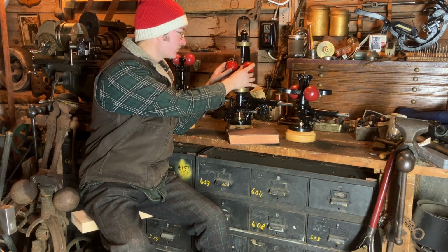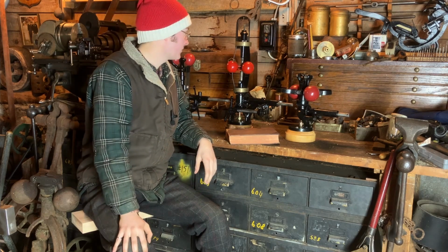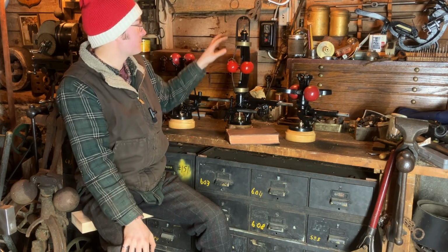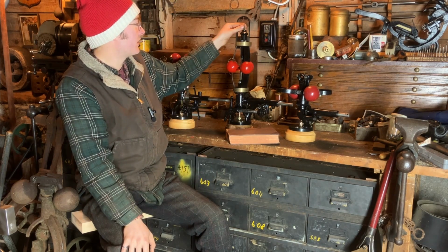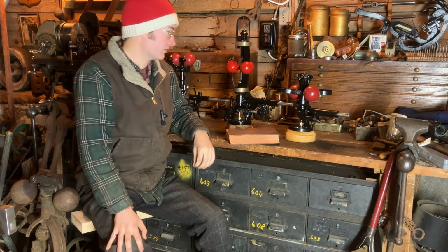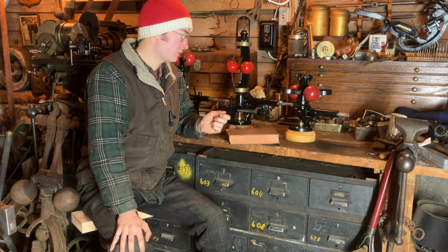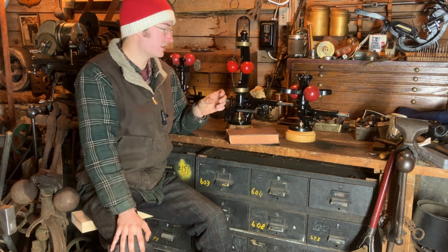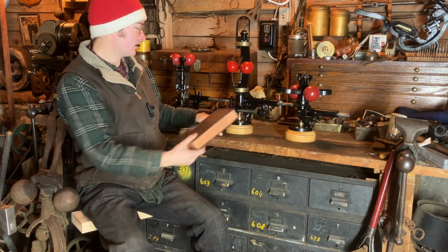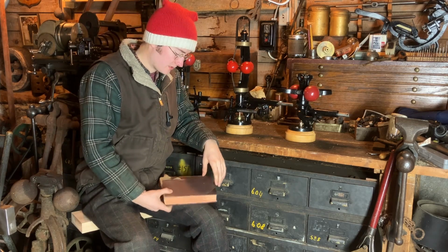These balls, painted red, expand due to centrifugal force. And when they do that, they apply some force to a rod, which is in the center of all of these governors. And based on the model, that rod might go up or down, which controls a valve in a chest, which is normally sat below these governor top castings here.